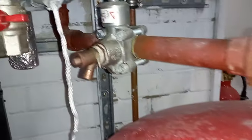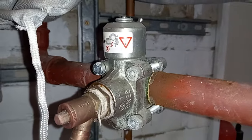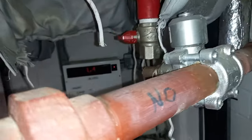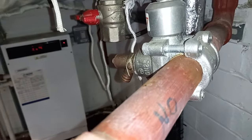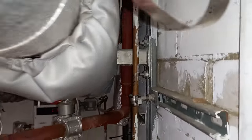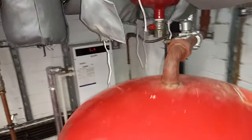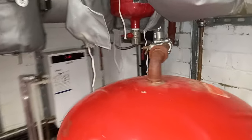Down there is something interesting — I don't see much of this. You go into plant rooms and you'll see something you've never seen before, even after years. Instead of draining it down, they've cut one of these drain-offs in. It must cost a fortune to install. There's an isolation valve up there — maybe it was letting by and they decided to cut one of these in. Not sure what make it is.